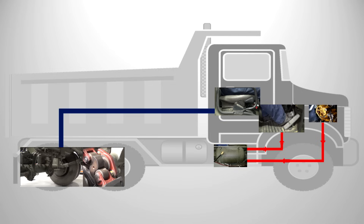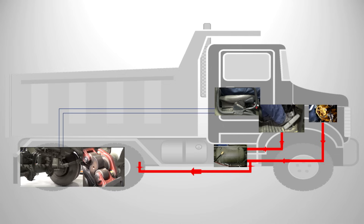How do we solve this? By fitting a relay, which is a device designed to speed up the application and release of the brakes. What we've done is put a relay at the back close to the rear service brakes, and also put a reservoir there so it's got a nearby supply of compressed air. Now we only need a signal pressure to activate the relay, so we can use small pipes, allowing the signal to get from the foot control valve to the relay much quicker than with our previous large piping.